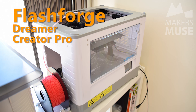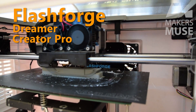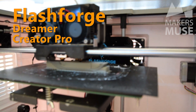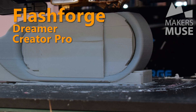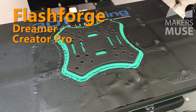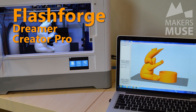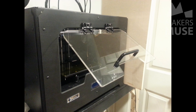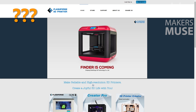Now we're moving up into dual extruder territory with the Flashforge Dreamer and Flashforge Creator Pro — both fantastically built Chinese workhorses. I describe Flashforge machines as what MakerBot would have been if they'd continued improving the 2X rather than releasing the terrible MakerBot 5th gen. The Dreamer is a maker's dream, capable of printing all but the most experimental filaments — I've printed flexibles, ColorFab Bronze Fill, and ColorFab XTCF20 Carbon Fiber with no issues. The software Flashforge provides leaves a little to be desired, but Simplify 3D really unlocks the potential of these machines. The Creator Pro has a nice metal chassis compared to the Dreamer's plastic but lacks the touchscreen. I'm secretly hoping Flashforge will release something like a Dreamer Pro combining the best traits of both.